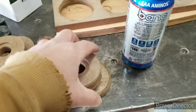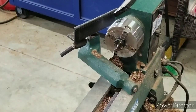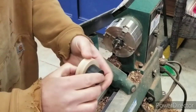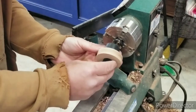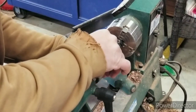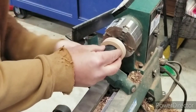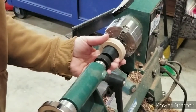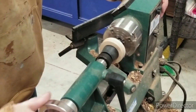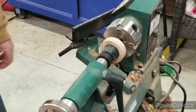I'm going to put them on the lathe and make these three a little bit smaller than those two, but they'll still all be bigger than the originals. This rubber stopper fits in here — it's a snug fit, I got to kind of twist it in. The hardest part is getting this centered on here as best I can. I'll use my other live center instead — put a little bit more pressure on here; it doesn't have to be super tight. It kind of trues itself up — this is really just for sanding purposes.